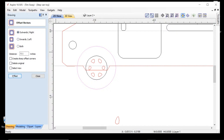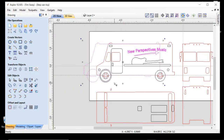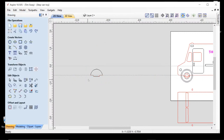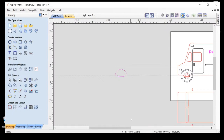The circle I have is the size of the wheel I want, but I need a space around it that's just a little bit wider for it to fit and spin. I used the offset vectors tool and experimented with the size, settling on one tenth of an inch to figure out how big of a hub I needed around my wheel. I then copied the truck and this new shape, moved it off the board, used my snipping tool to cut the excess away and make one solid vector, then moved it back. That shape is going to be the hub that gets cut away so the wheel can fit inside the truck.